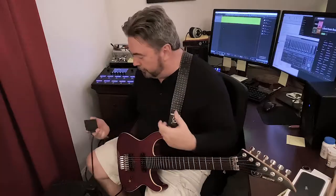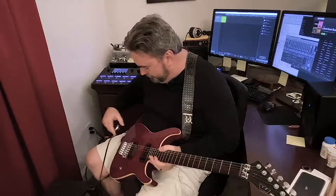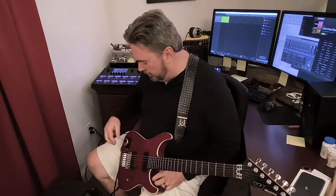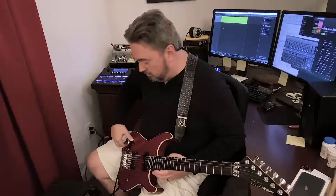But the best place you can put this is on your guitar. The location on your body where you want to put it is really going to vary, so try a bunch of different places. You do want to stay away from the electronics so the coil doesn't get picked up by the pickups. I found that putting it over to the back of the body works out really well.